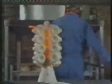First, they're placed in a steam autoclave, and from there they go into a 900-degree centigrade gas-fired oven. It's absolutely essential to lose all the wax, hence the name, the lost wax process. Any wax left could ruin a very expensive casting. All the trees can then be cooled and left to stand on shelves. They're extremely heavy now, but still brittle. The molds are heated again for 4 hours in a furnace, and they're then ready for casting.